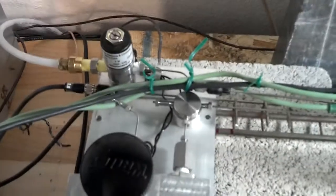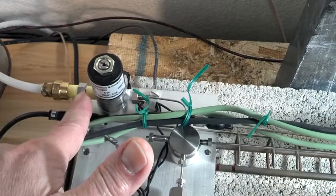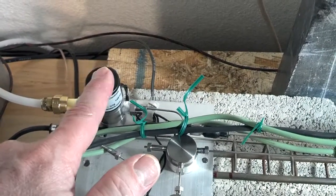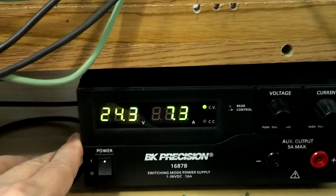What you see here is a back pressure regulator. This small tube is coming from the reactor tube. The pressure sensor is here, the solenoid operated valve is there, and the orifice is there to slow down the evacuation of gas from the reactor so that the solenoid valve has time to respond. The data acquisition is over here on the other side of the aluminum shield from the reactor.